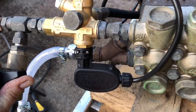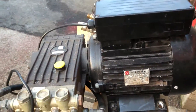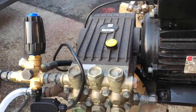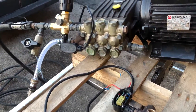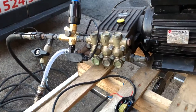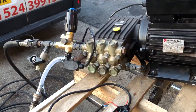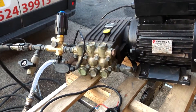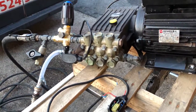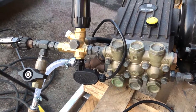All I'm doing is making that leak. Every time you let go of that trigger the machine stops; pull the trigger, it starts. If you're in the valeting system, you need to leave the machine running and bypass this system — make it flow and return — or you need to put a timeout setup in place. You can let go of the trigger and the machine shuts down immediately, but if you're not doing a job it shuts itself down after a period of time, either on a pressure system where it starts back when you pull the trigger, or it times out and you press the button to start it back up.